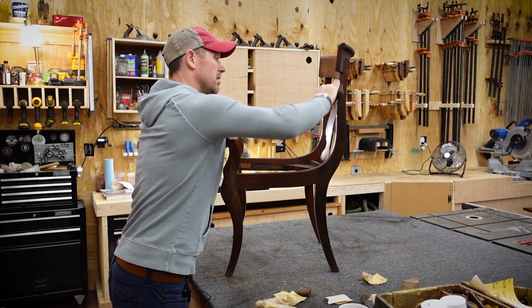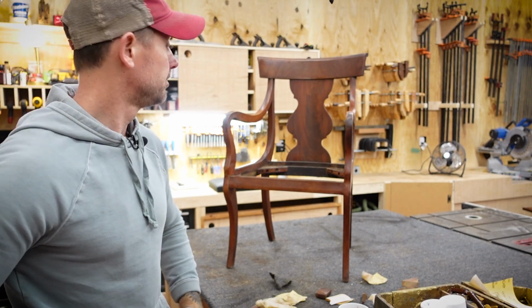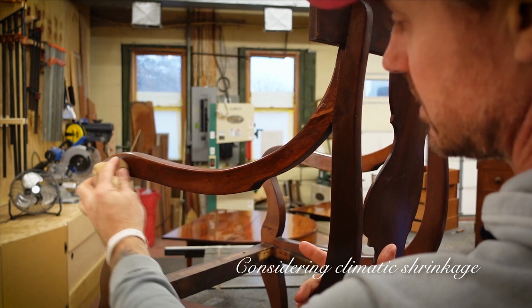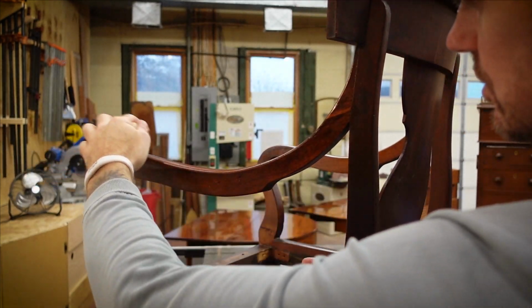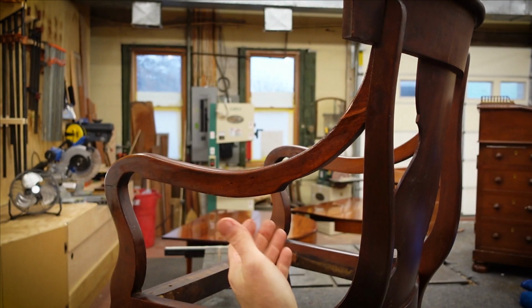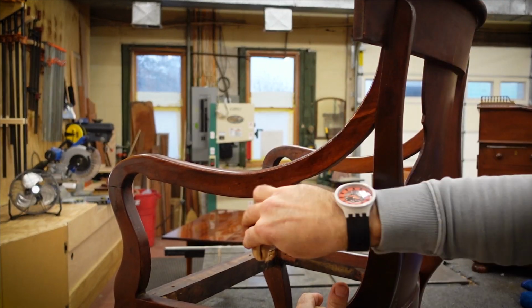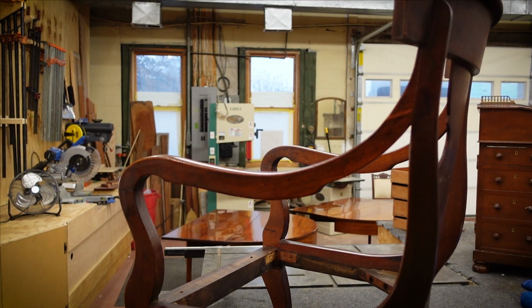So now that our chair's been glued and filled, it's ready for some finish work. That's the next step. That's where we sanded the finish and blended this in. And a lot of antiques, especially with wood, the wood has a tendency to cup, twist and bow and do all sorts of things. I mean, wood is essentially a very dense sponge. It's very susceptible to changes in the humidity and everything in the environment. So it's very difficult at times when something's been cracked and broken for a long time to get it back exactly the way it was. And that was the case here. This break had happened quite some time ago and had never been properly repaired. And so now we're just trying to get that through. So I got a nice coat there. You can see here that we have some lacquer on there. So what we're gonna do is just a minor touch up using a few pigments here.